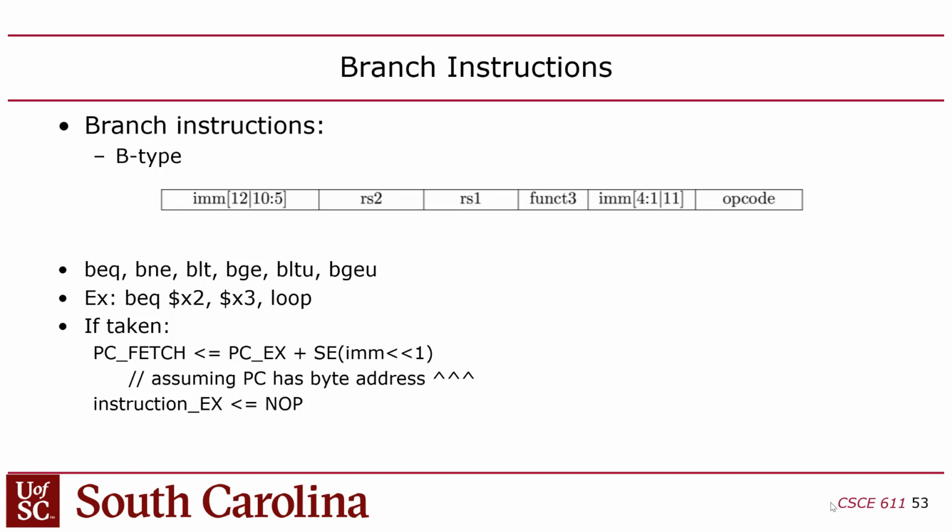Well, the reason they do that is because RISC-V has a 16-bit mode. ARM has that too, by the way. ARM processors, like the ones in your phone, have a mode called Thumb mode that uses 16-bit instruction encoding. RISC-V has the same thing because they kind of copied that from ARM. That's something that MIPS didn't have, by the way. MIPS had no 16-bit mode. RISC-V and ARM have 16-bit modes.